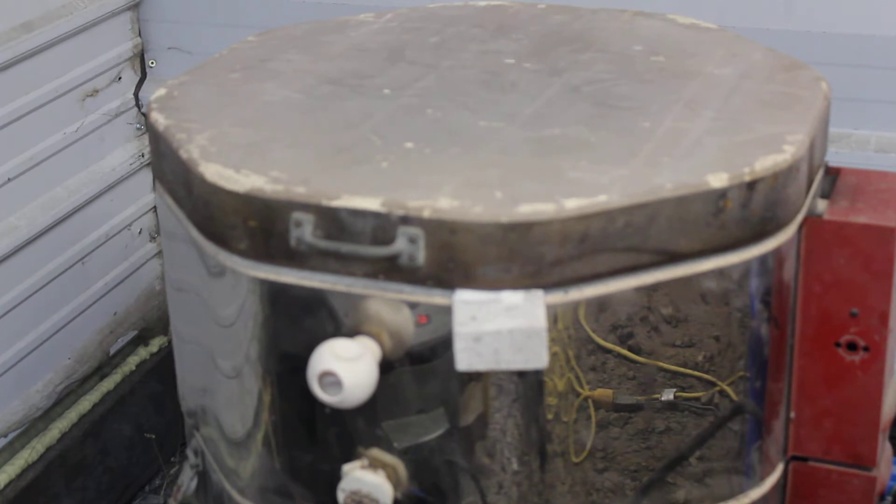What you see right now is an old high-fire ceramics kiln that was decommissioned quite a while ago. I got it pretty cheap, but the settings on it were just high, medium, and low — and that's not really good for casting mirror blanks when you need to be within a degree or two.